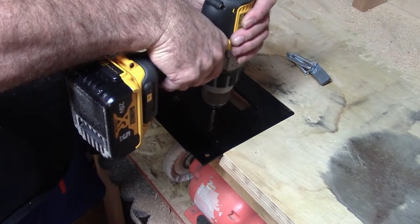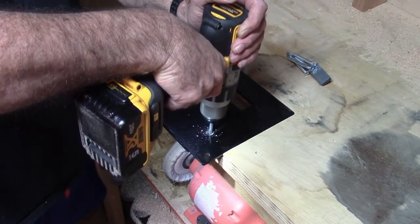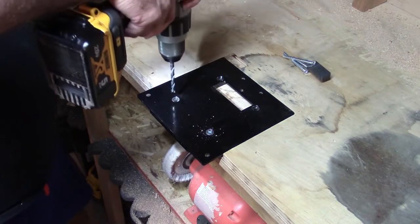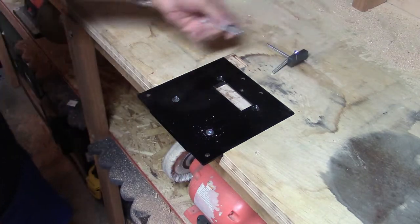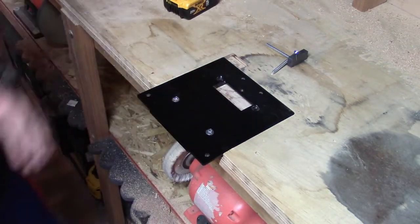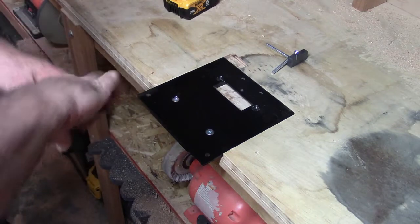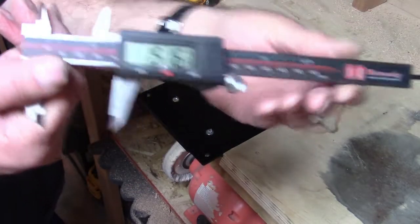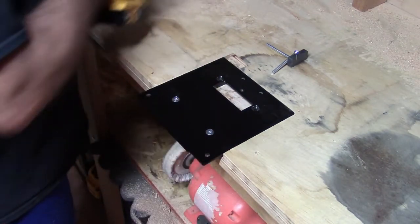You're gonna come along here like this, be as vertical as you can. You'll drill your first hole, place your first screw into place, then do your second. Drill your second one into place. If you feel that this has shifted at all, if you're even second guessing it, you can come back over and, you know, never hurts to check your measurements. But we're good. If you've done a good job of routing this in tight, this isn't going to shift. So if we come over here like this,